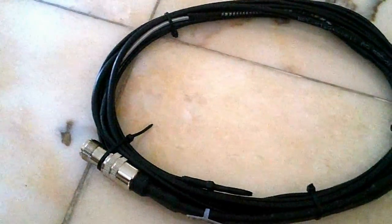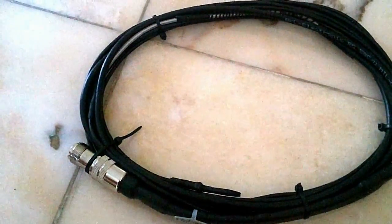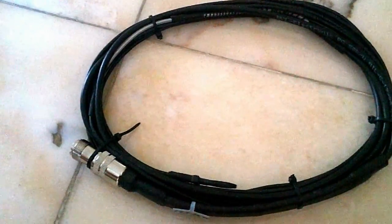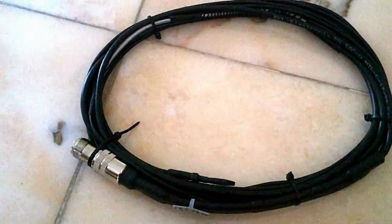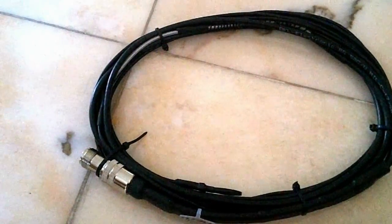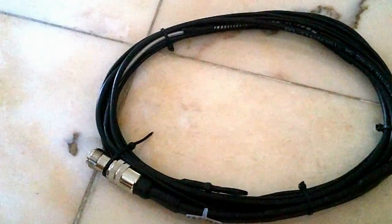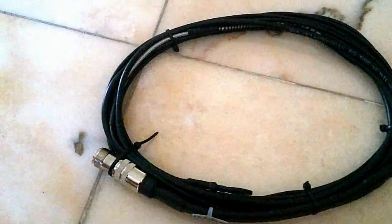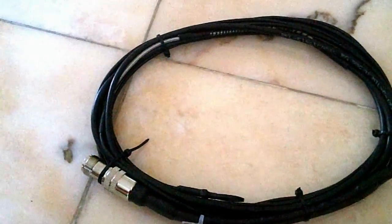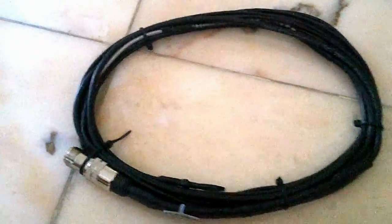The antenna here you see wound up is a Lambda Halber antenna made in Germany by Willy, and it is special for the UK market. It's resonant from around 27.5 to 27.991, so it does the UK channels, the 27, and down to just roughly where the triple is.